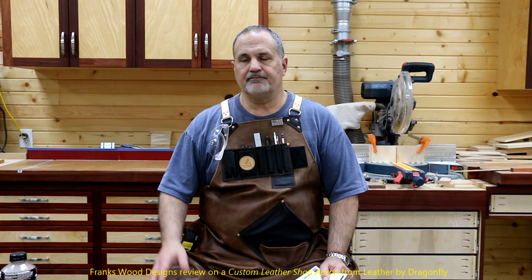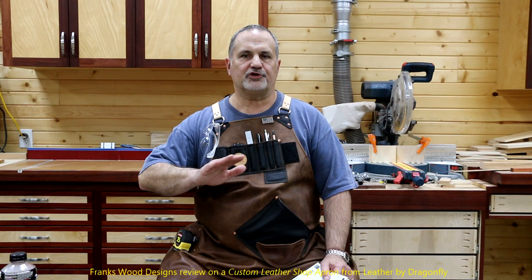But unfortunately, about 4 years ago, I had a pretty severe kickback here in the shop. I was cutting a piece of plywood. I was pushing it along the fence. The piece was probably a foot by a foot. Did not have a splitter on the back like I have now. And I believe what I was doing, I was not pushing up against the fence. I was actually pushing it quickly and kind of pushing it toward the back edge of the blade. And that thing shot out like a shotgun and hit me.